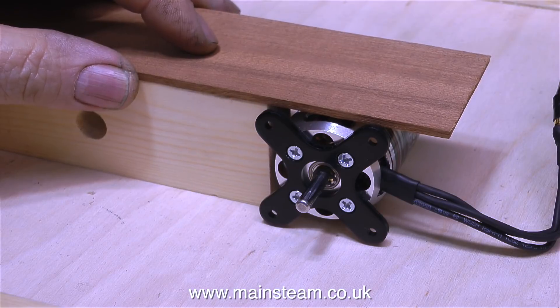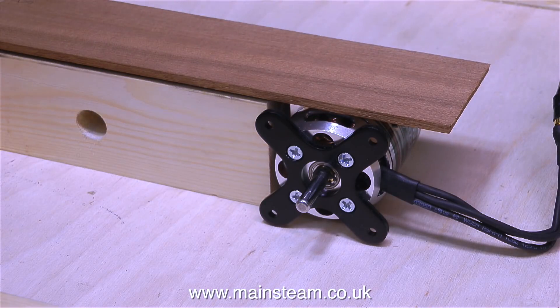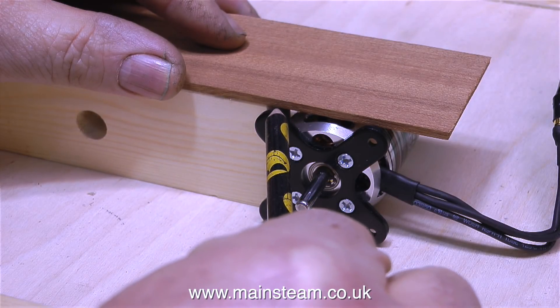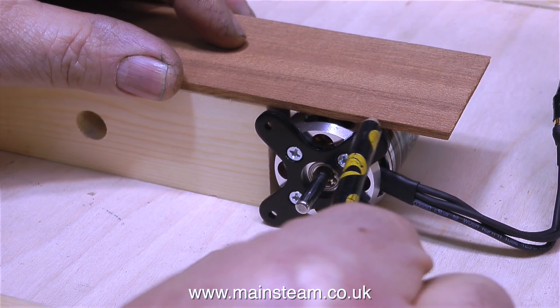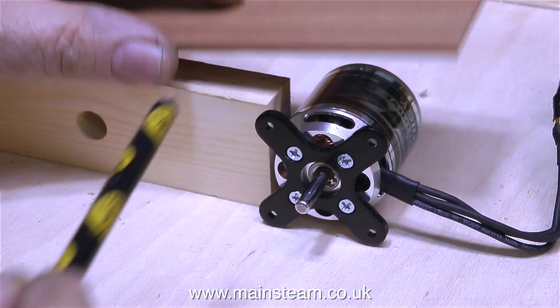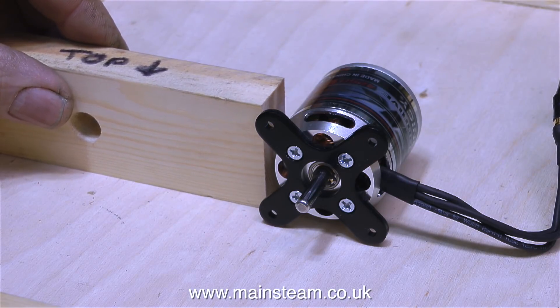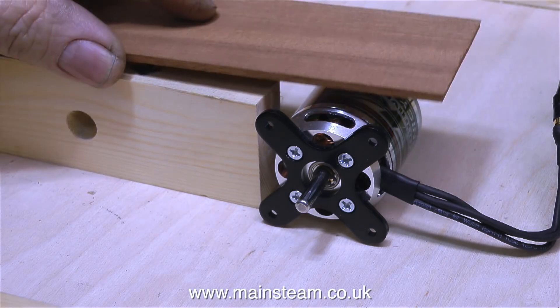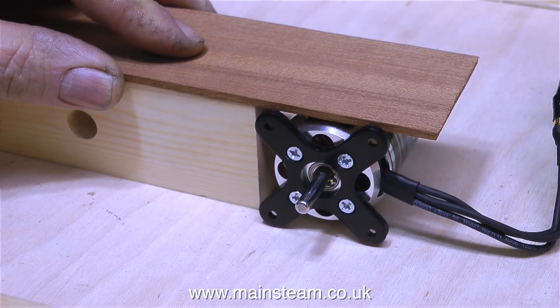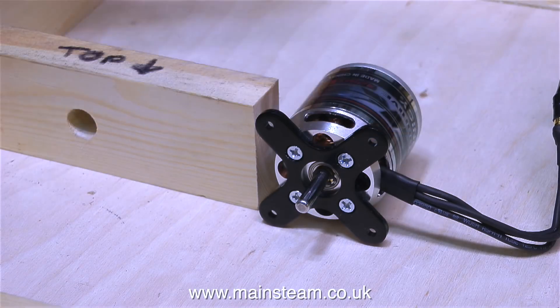All the way round the top edge of this softwood will be a hardwood capping, pretty much like this but a bit smaller. The so-called 2x1 softwood I use, which is really a metric equivalent, is a little bit small for the motor mount. I could grind off some of the motor mount but I don't want to do that — I think using hardwood cappings all the way round is a better solution. This piece of mahogany from my box of random pieces is 3/16ths of an inch thick, and once cut to the correct size and stuck on top of the softwood all the way round it will look the part and do the job.